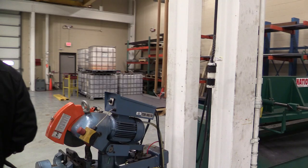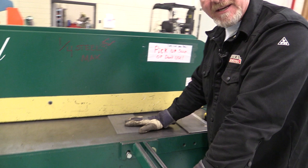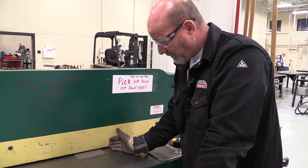Let's go back around to the front side. If I want a three-inch piece, I measure to the back gauge, run my piece in, and now my piece hits the back gauge. I cut that one off, run the piece in again, and so on and so forth.